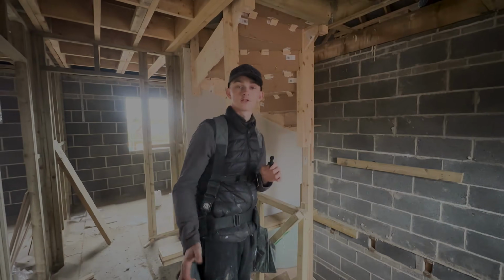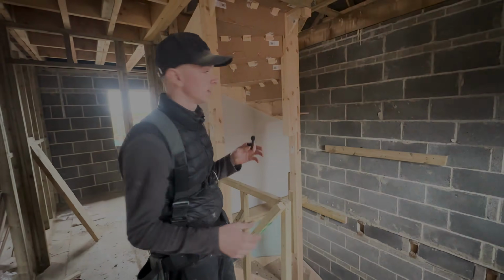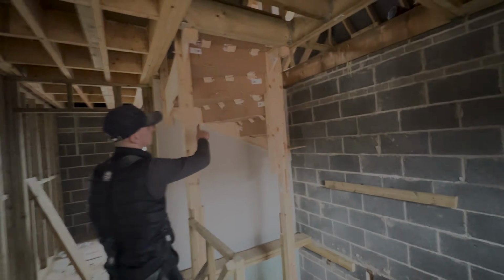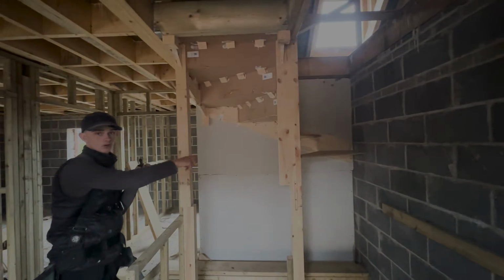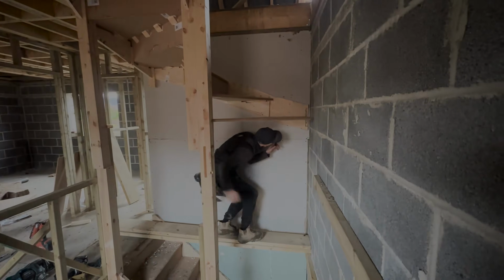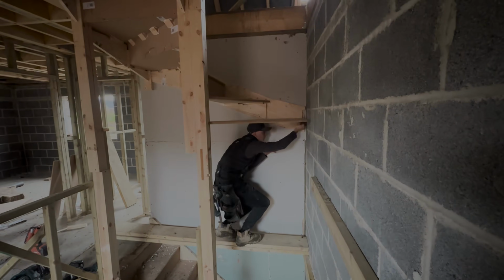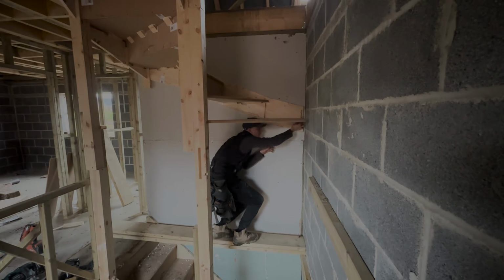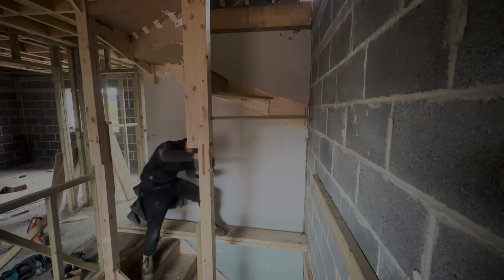Right, so this is the stage we've got to now. That is like a step basically. So we've got all of these in with glue blocks and wedged, and then we've got the full kite on the corner, as you can see in there. I'll go over. We've got that in and pulled back enough so that once this other section comes up in, we're about 2mm back. We want to be 2mm back to get that other tenon in there, like the join.